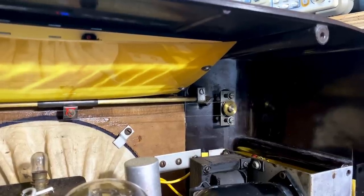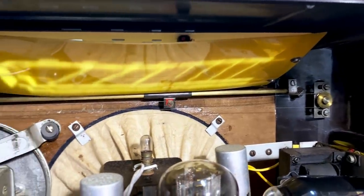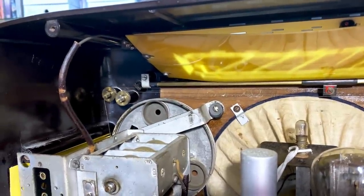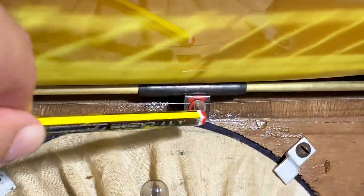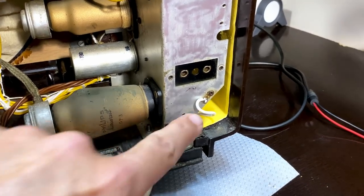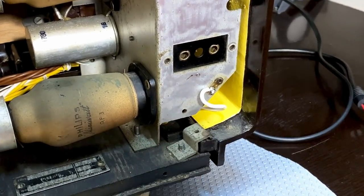And as usual, it's easy when you've seen someone do it. So, Don, thanks very much. I took your advice. I used some chopsticks and it worked. Brilliant, so that's on. The top piece of the wire gets pinched in behind that washer and you tighten it down and that holds the pointer in place. All we need to do now is to align it, which we'll do next. And of course, we can't forget to solder the ground wires, the ground from the shields in place on both sides. So that's also done.